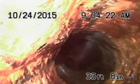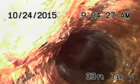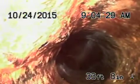I'm going to recommend repairing — actually replacing — all of this up to the point where it transitions back to cast iron. This is definitely underneath the house. It's about six or seven feet of pipe that needs to be fixed, replaced with either plastic or cast iron. The cast iron pipe underneath the house looks like it's in pretty fair condition with some minor buildup. Then we go to the ABS plastic pipe, which has obviously been replaced at some point, and this all looks good.